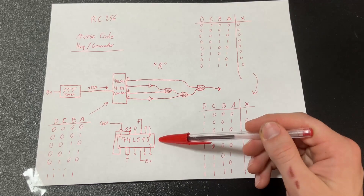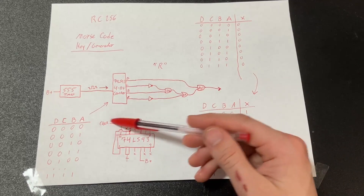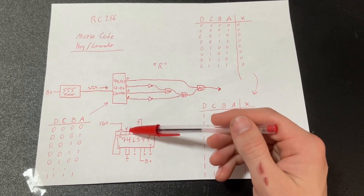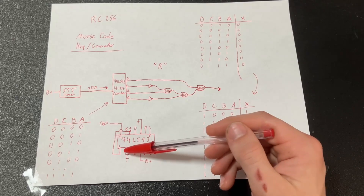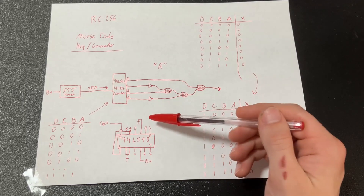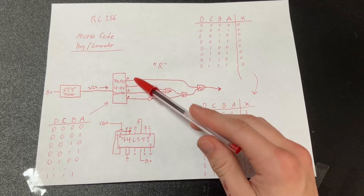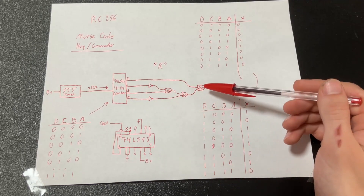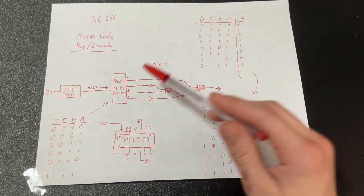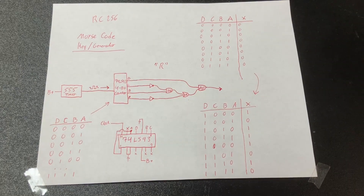If you're curious on how to wire one of these up, I drew it out here because it's a little complicated. Put power in there, ground there, clock comes in on pin 14. You have to tie the output of A into pin 1, tie pins 2 and 3 together and send them to ground. All of these X's denote no-connect pins, and then your outputs are A, B, C, and D. These four pins are fed through a filter of five logic gates and produce an output. Because these keep changing, we can produce a truth table. What I've done here is created a hard-coded ROM that has four bits of address and one bit of data output.